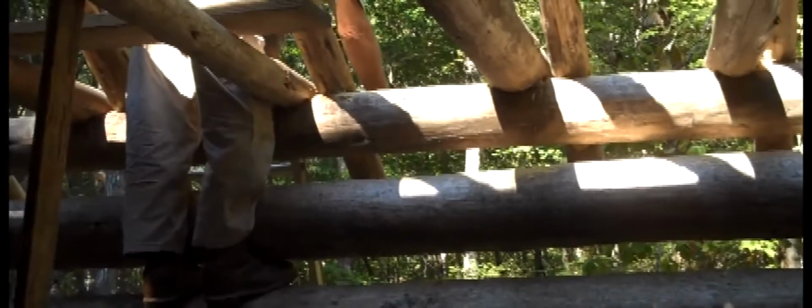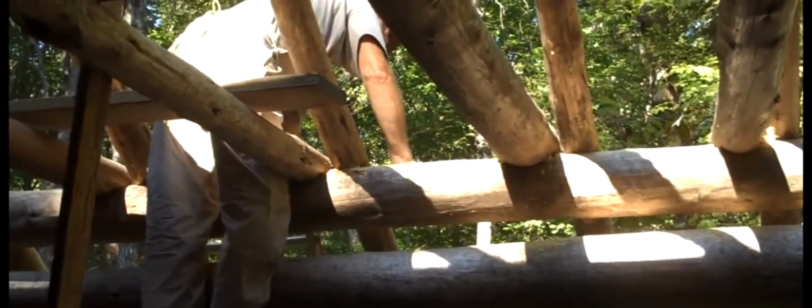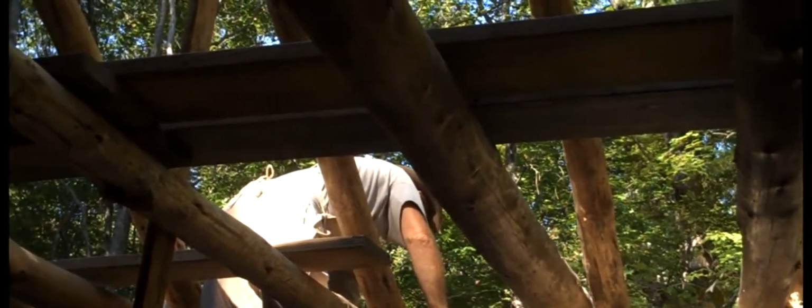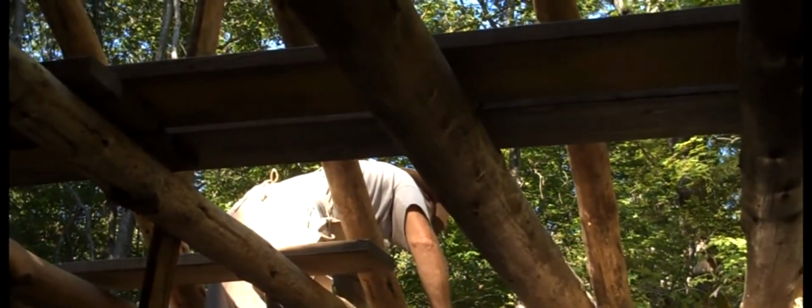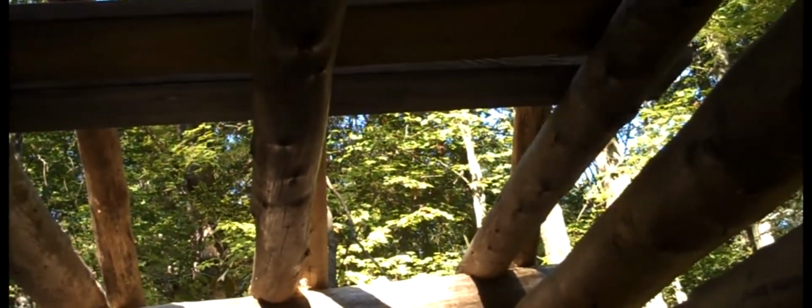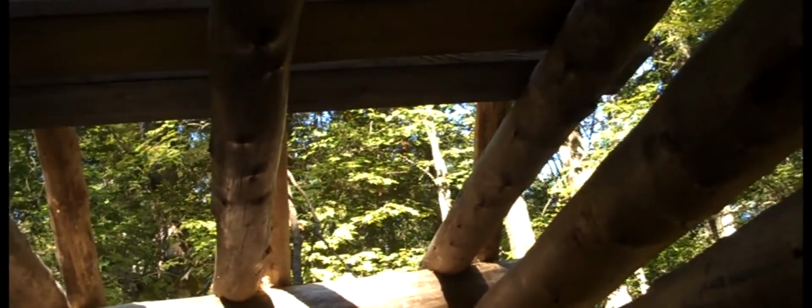Alright, now the proper place for this first lath across there is at the very, very end of these rafters. That's the slanted poles that are the very top of the roof. And then it will be 15 inches overhang on the end here. And then all the other laths that are going to go up this slope on these rafters here will be measured from that first one.